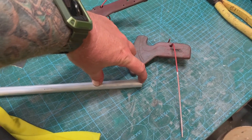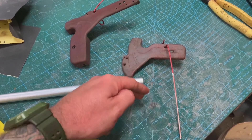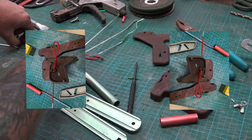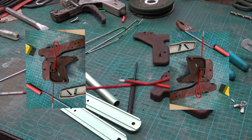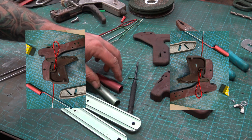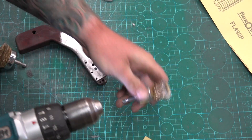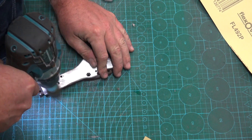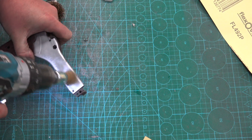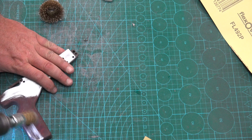One of the biggest giveaways was the rods themselves — they were anodizing brilliantly. The first couple of times they weren't in long enough, but I was now getting them coming out perfectly red. So my trial and error fault finding led me to blame the item itself. I decided to cut off a little bit of this aluminium bar and see how it goes in comparison, gave it a quick run through, and tried giving the two parts a very long bath. The research then led me to believe this aluminium probably isn't pure enough — it's probably got zinc or magnesium or something to help with the intricacies of the mold they're casting in, for overall strength and durability. People don't just use pure metals; they add stuff. Which means a lot of my plans for anodising pre-cast things are just thrown out the window.